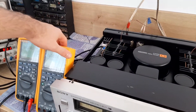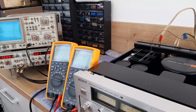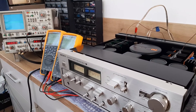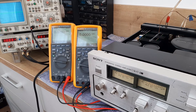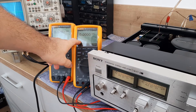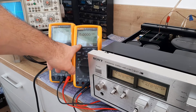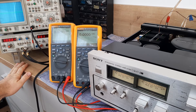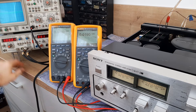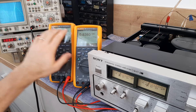The dummy load is connected to speakers number eight, which are already connected. I'll arrange the camera to be visible. According to the manufacturer manual, the speaker outputs should read 8.9 volts AC across eight ohm dummy loads at 1000 Hz frequency. We already have 1000 Hz set; now I will adjust the volume and look for 8.9 volts on the oscilloscope.